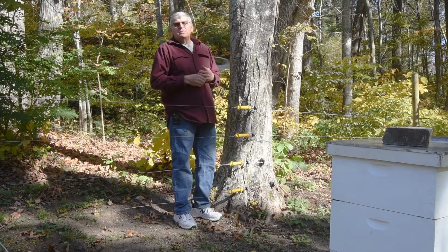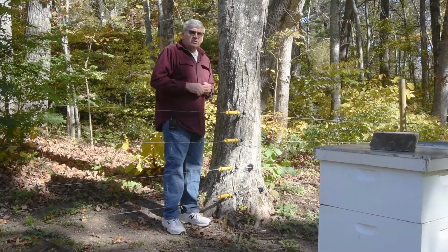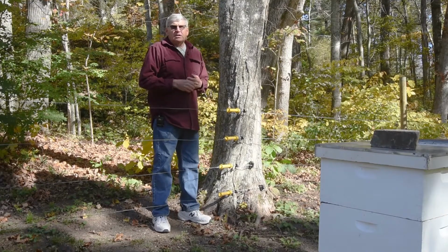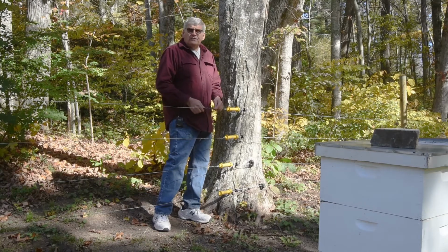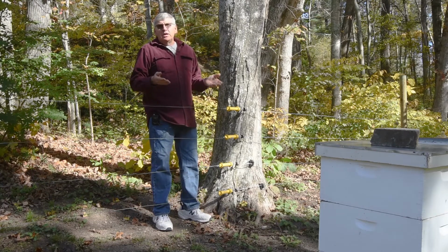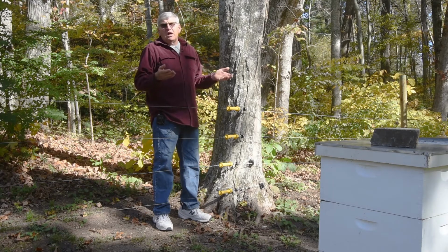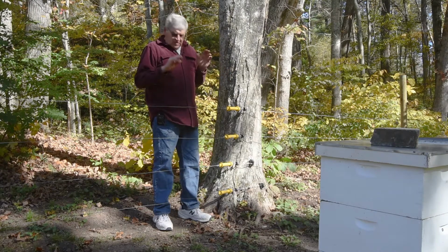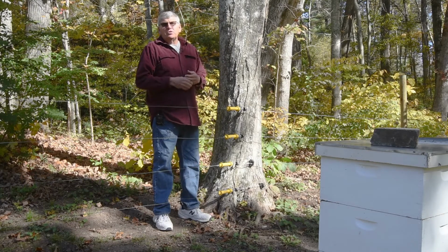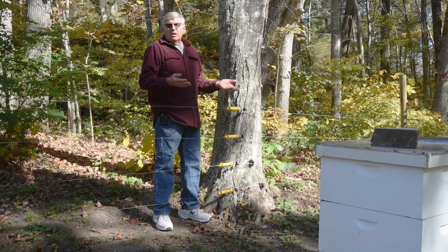The only other thing that I will say is this: when you're buying electric fence chargers, solar chargers, I've got well over a dozen electric fences, and I found that the inexpensive solar chargers that you can get at Tractor Supply do not last very long, and Tractor Supply is not very good at standing behind failed electric fence chargers. I have switched all of my fences now over to the Parmac 12-volt solar panels, and you can get 9,000 volts of DC current into that fence with those chargers, and they last for years and years and years. Occasionally the batteries will go, you can get new batteries. I've had much better results with spending the extra $100 on the Parmac chargers.